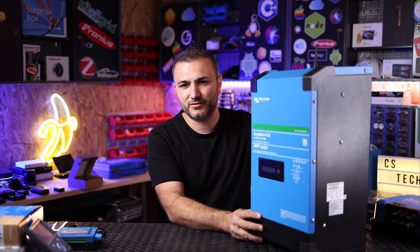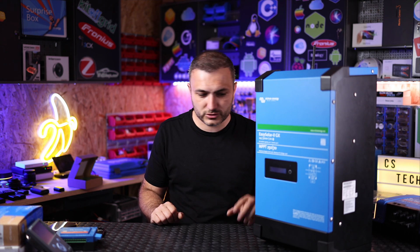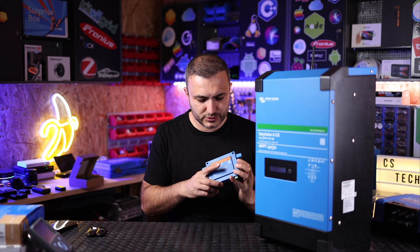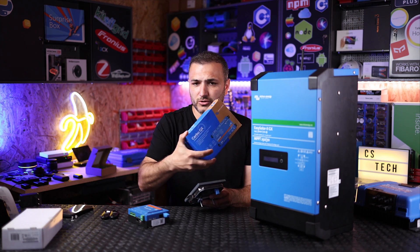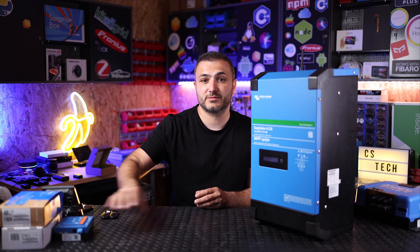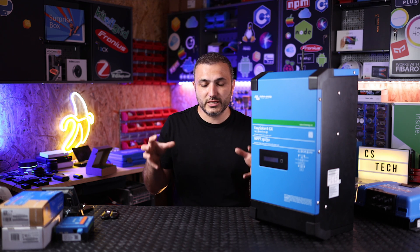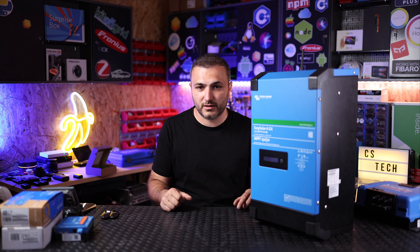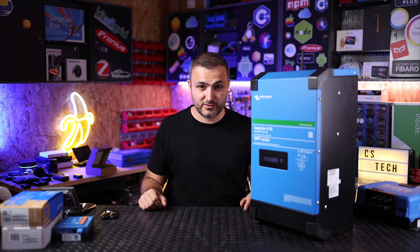Let me explain what devices are already built in here, and let me give a small overview of how Victron's system works. First of all, we're going to start with a brain, because each Victron system needs a brain. The brain unit is named GX. As you can see, there is Venus GX, I have a Color Control GX, and also I have Cerbo GX, and the latest one from the market is Ekrano GX. All these devices do the same thing — you receive information from various sensors or various systems from Victron, put them on the same app, and broadcast them to your mobile app, to the Victron VRM portal, and from there you can see the production, the graphs, the consumption, and enjoy the entire Victron ecosystem.